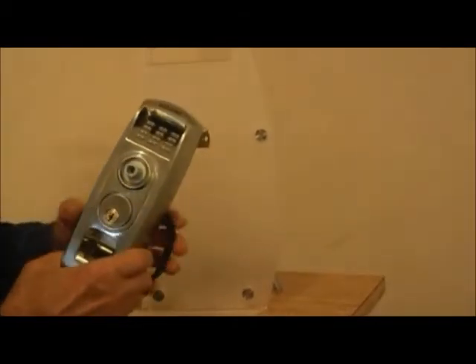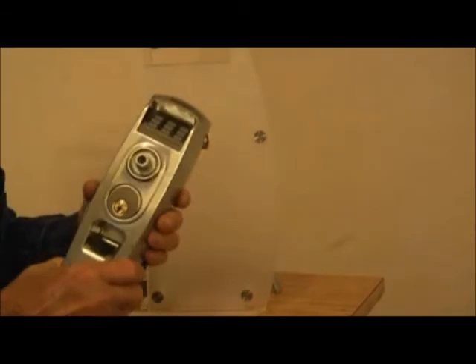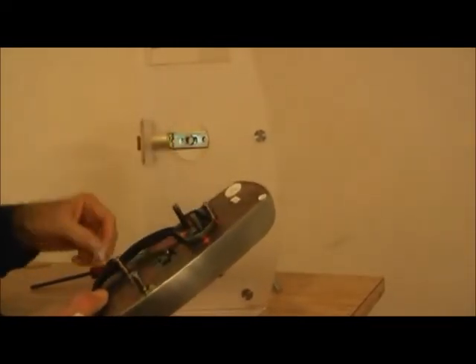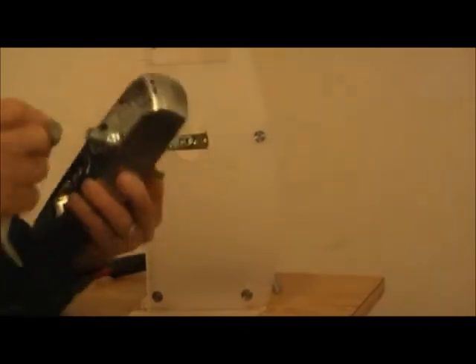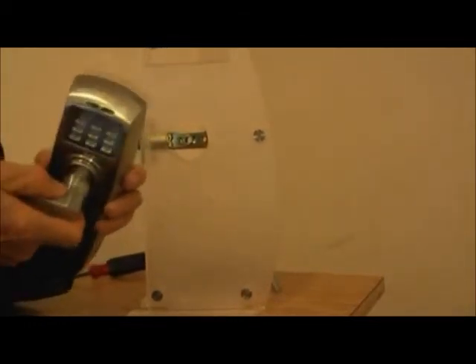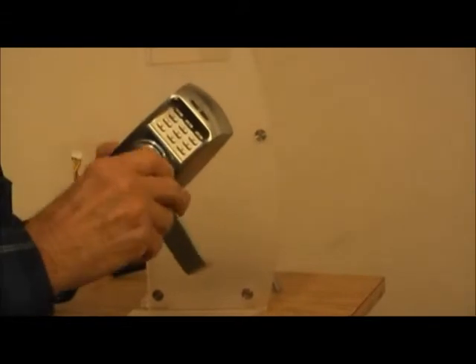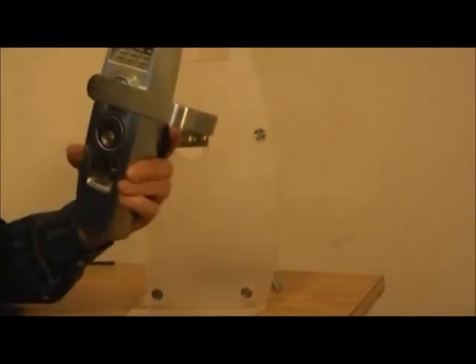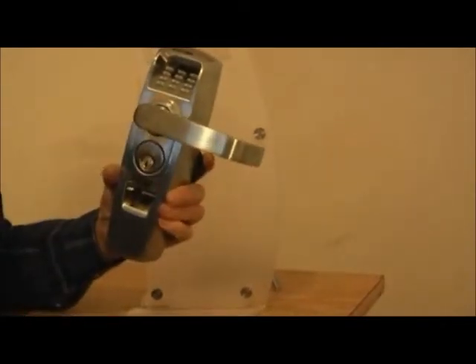For the next step, here we have the Reli-Touch outer portion of the lock with no handle mounted on it yet. We're going to mount the handles. There is a piece of paper on the back of the lock that holds the handle screw. The handles are interchangeable, so you can use either of the two handles that are in the box. You use a long screwdriver to drive the screw down nice and relatively tight on the handle, then turn the handle to make sure it moves smoothly back and forth.